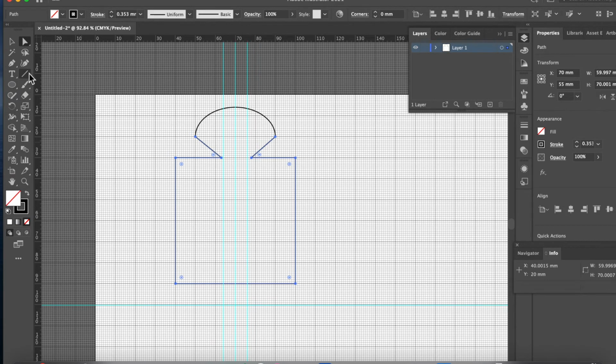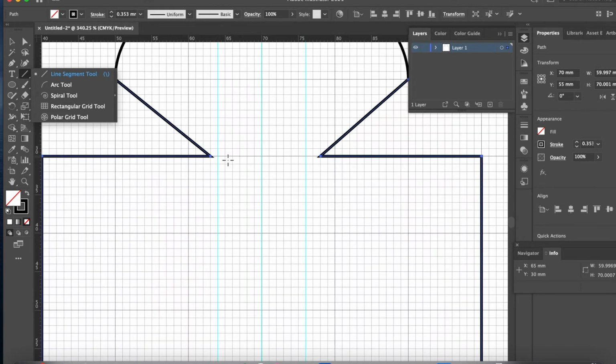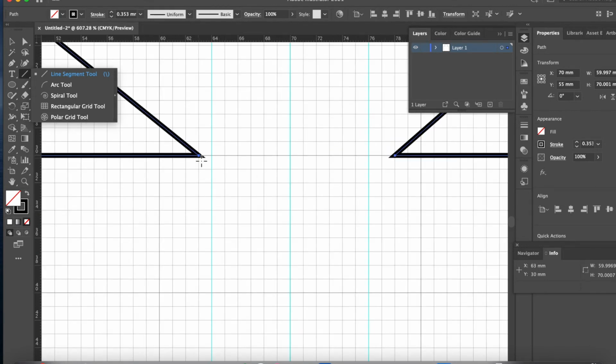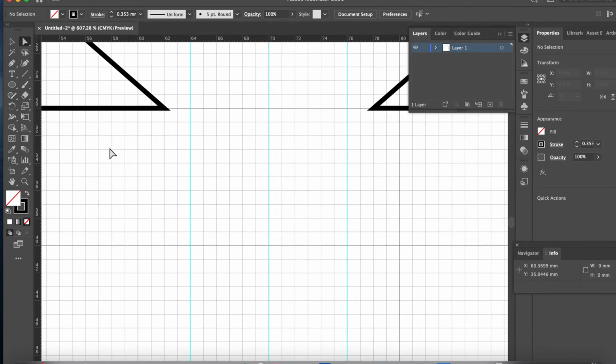And then when you are looking at putting in the slots that you need to slide these into, you're going to want to make sure that in this case it needs to be whatever this solid distance is. Okay, so 16. So this is our 16 right here. Maybe what we're looking at is a 16.5 or a 17 millimeter slot for that to fit into. Well, let's see what a 1 millimeter differential does for us anyway.